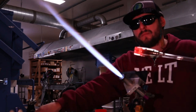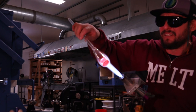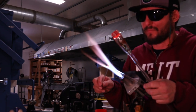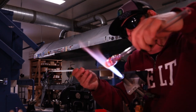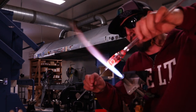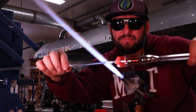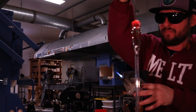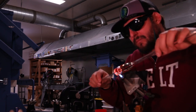A couple final little shapes here — you can see it has a nice little taper and it's the exact size that I want it to be. Now we're going to take all the tool marks off there and we're going to handle up with some 6mm to the bottom of this so we can open the other end and flare the shot glass out. I'm just cleaning up this 6mm handle really good. Obviously you want this as centered as possible. I'm going to take this to the roller and use the jacks to flare it a little bit, building up just a little bit of a moil there. Make sure you have a nice, good hot seal — you don't want a cold seal here, it has potential to fall off while you're tooling it. I'm going to go back to the little laser flame here and just make sure everything is really tightened up with this seal.